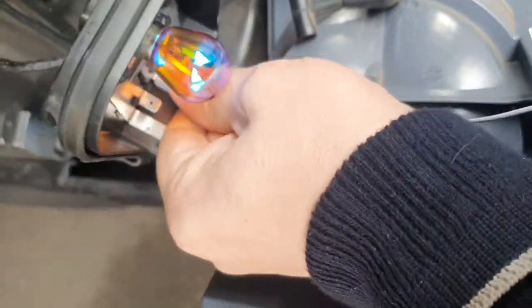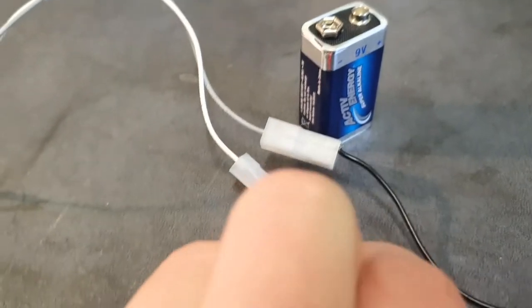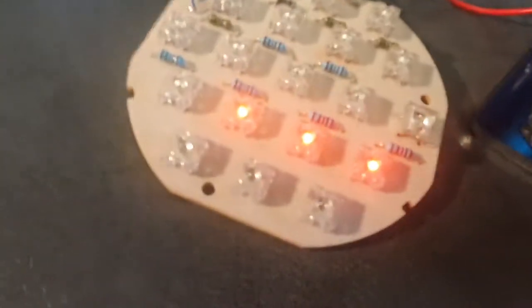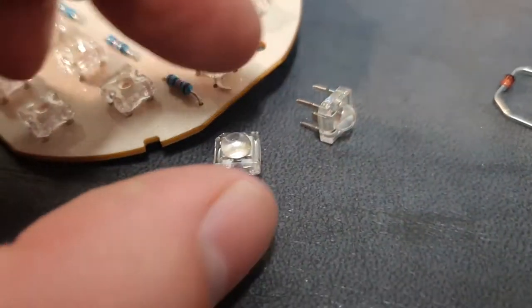For testing I made a separate unit using a simple 9-volt calculator battery and plugged it in. Remember that the small plug is actually positive and the large plug is negative. With that connected, we've only got three working LEDs. In fact, one of the LEDs has obviously failed — it's burnt out.